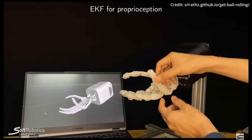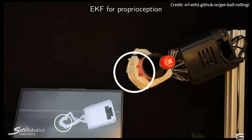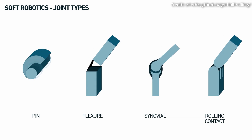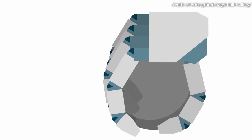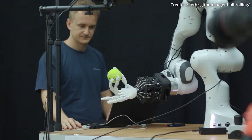In fact, each finger even contains a coupled joint at the distal end, reflecting the complexity of human anatomy. But unlike traditional robotic hands, the FIVE Hand employs what are known as rolling contact joints. These make a stunning difference by employing joints that consist of two articulating bodies with adjacent curved contact surfaces, allowing for much more natural and flexible ranges of motion, simulating highly nuanced movements.